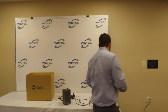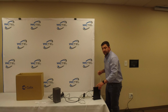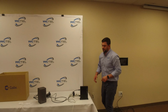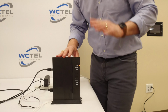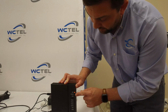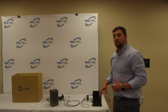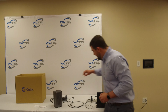So the first order of business, what we're going to do is get this power strip, plug it in, and right now the only thing that's plugged in is this 812 ONT. So we'll plug it in, and once that's plugged in, it'll take about 5 or 10 minutes for everything to come back up. But you'll have a power, broadband, and service light. All those lights will be solid green. And once that gets solid green, we'll be able to hook up your Gigaspire for your wireless.